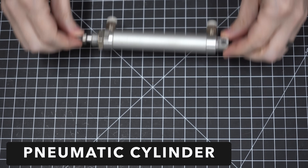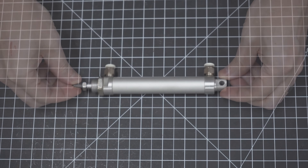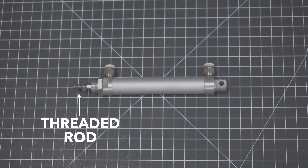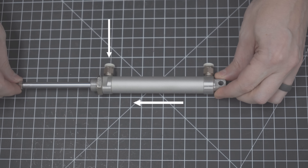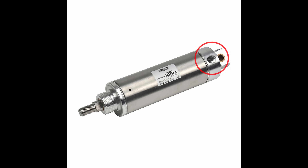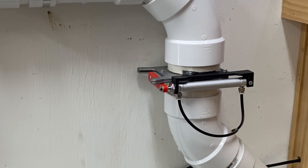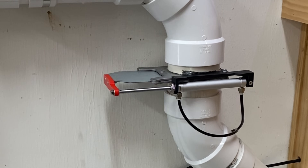So the first problem to solve is how are we going to automate opening and closing the blast gates. For this I chose to use pneumatic cylinders. A pneumatic cylinder sounds very technical but it isn't — in fact it may be the most simplistic piece of this whole system. It is simply a tube with a piston inside of it, with a threaded rod at the end. There are two air ports on the side, one at each end. When we apply pressurized air to the far side it forces the piston out; when we apply air to the other side it forces the piston back in. This style is called a double acting cylinder. I wanted the extra force of the air to ensure it forced any excess dust out of the blast gate, though you could save money by going with a single acting cylinder if that wasn't a concern.